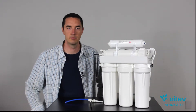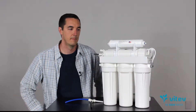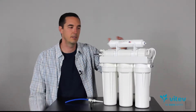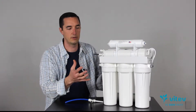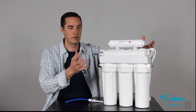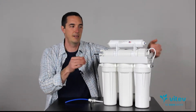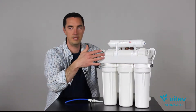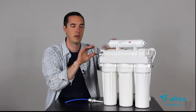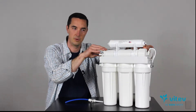There are really two main categories of RO systems, at least when it comes to installing a post cartridge like the Remin. The first is what we'd call the old school RO — you can still get these brand new, but the style is what ROs initially looked like years ago. You can tell this category apart because you have access to the tubes, the connectors, and the in and out on the membrane itself. You can get to the connectors, change the tubes, and make adjustments — and that's what you'll need to do with the Remin on this style.